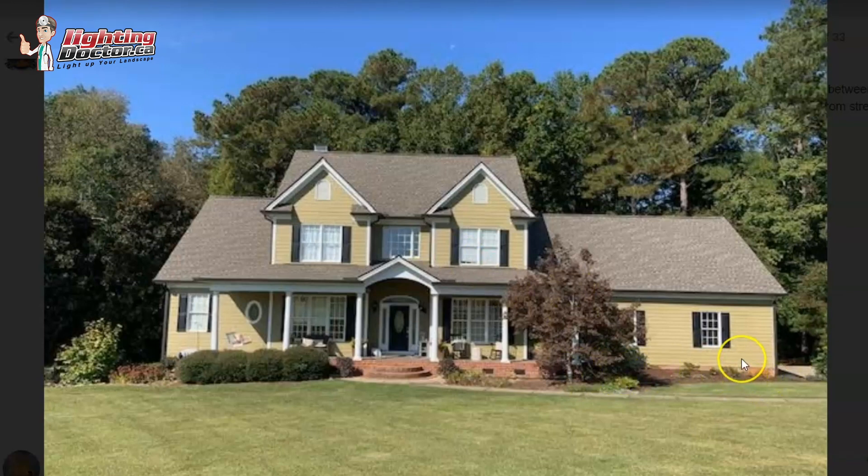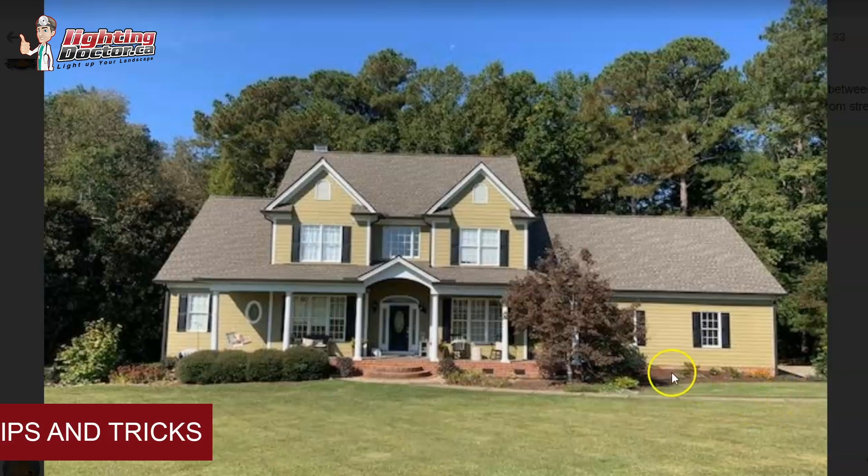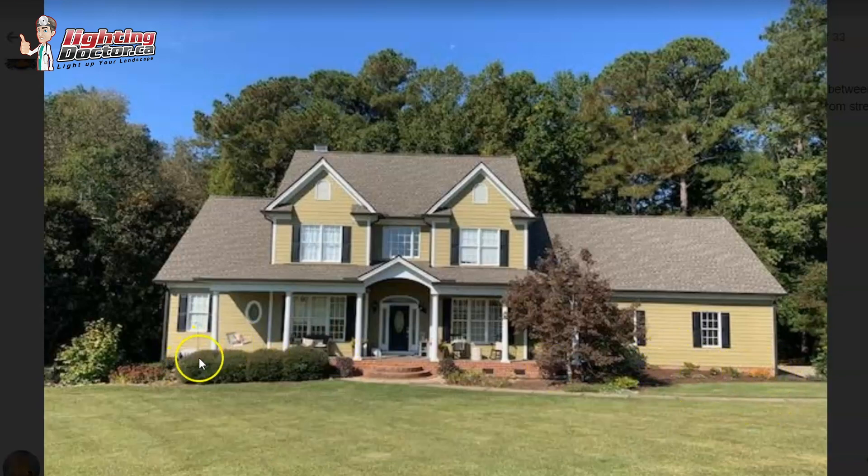Along this side of the house, I would throw a couple of accent lights. With that 35 degree, I'd probably have one over here and bring it back a little further so you get some spread on both sides of the windows to light the house. I still like backlighting areas of the house so it makes the landscape in front stand out and you get some reflective light back down. I would do the same thing on the other side, keeping it symmetrical — probably have it more under the window shining up and highlighting those shutters. When you have that battery pack, you can play with placement under the windows on all three sides. And then a couple of path and garden lights would be a nice fit.